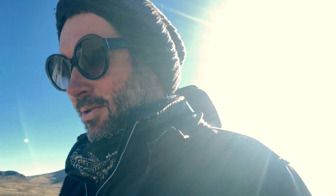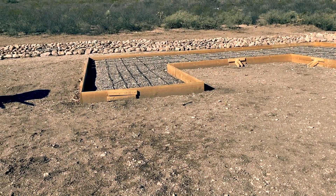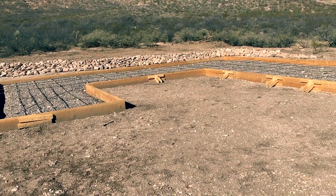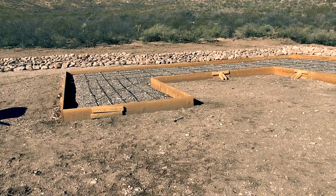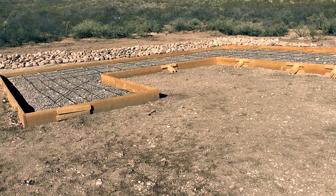Hey everyone, Adam here. About to finish part two of this off-grid build today. I just finished building the form for the foundation last week, and any minute now my concrete guy should be showing up to pour the slab. I'm going to flip the camera around and show you what I've got going on here. So here is the finished form — this is for a monolithic slab on grade foundation, which is just fancy talk for a big solid chunk of concrete that's all going to get poured at once. I built the form out of 2x12 boards cleated together with 2x4s, and I did it in a kind of unconventional way — pretty much the story of my life — but I'll explain what I did and why.